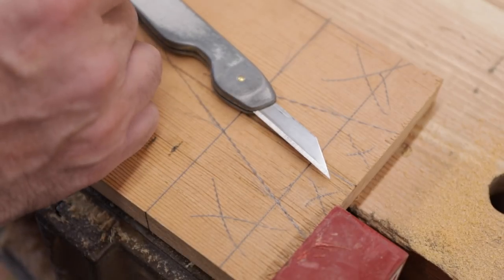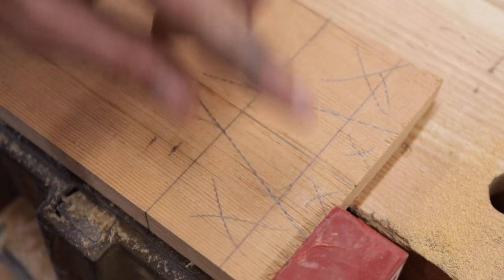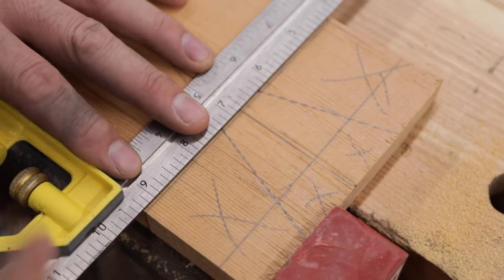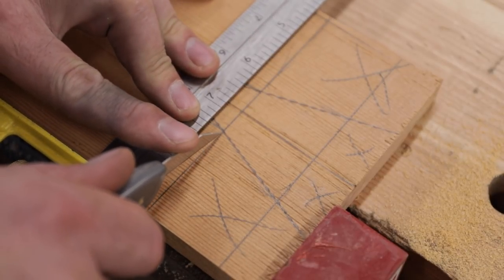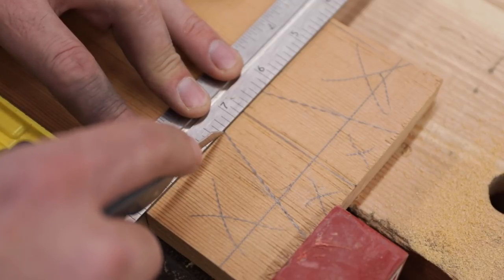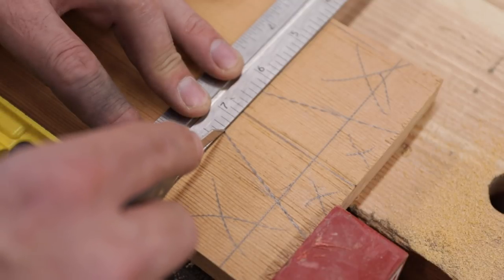Here's where we need to be a little bit more careful. We've got our five by seven and this shape right here — two inches comes down to one inch, so you find your center and draw that, then connect those lines. Since this is end grain we want our grain running this way — we can't plane it, so we have to have very precise cuts. Put your knife blade right on the line, bring the combo square to it, make sure it doesn't move, and use very light pressure with a nice pointed knife — an exacto knife or a marking knife.